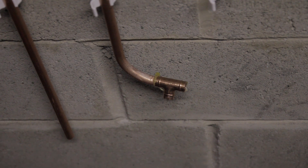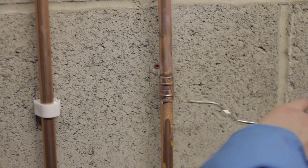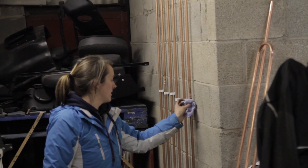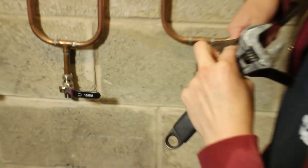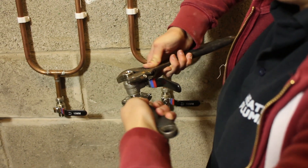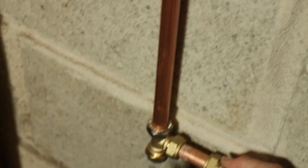Once the pipework is secured you can solder or tighten down your fittings. Wipe off excess flux to avoid corrosion of the pipe. We then ran the pipe to our desired outlet location. Make sure to fasten down the ball valves. As we're feeding two compressors into one pipe, and the pipe also needs a drain valve, we added a T-piece extension.